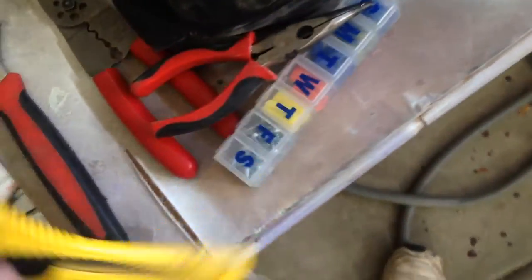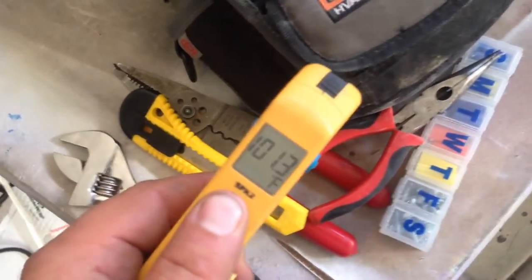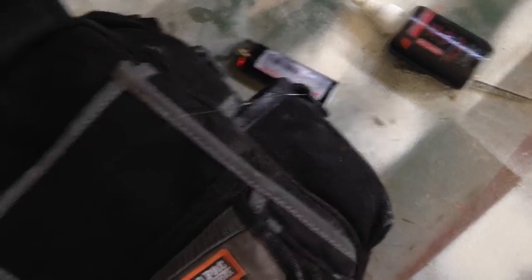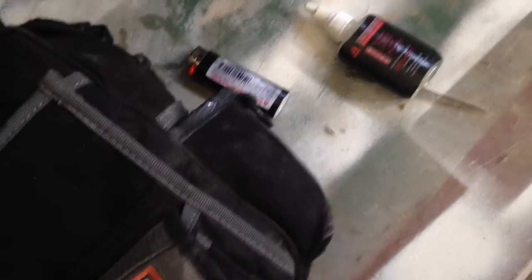On the side pouch I have a little razor blade and an SPK-2 for checking temp splits and ambient temperature. On this side I have some Nylog for sealing refrigerant lines and fittings, a lighter for when I do fireplaces, and some shrink tube. That Nylog is leaking really bad in that pouch.